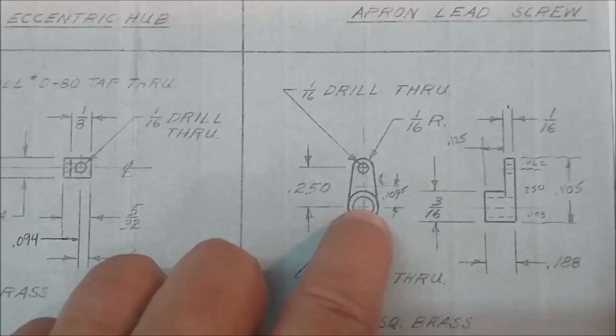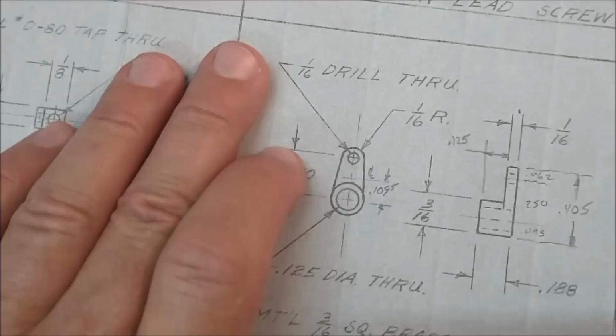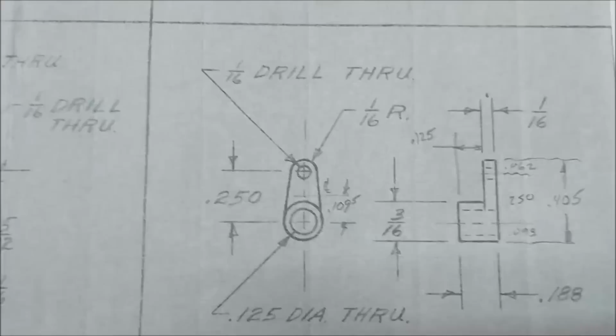This will then be home. I can drill that, I can ream that, I can interpolate this boss, I can remove all of this material, and I will be on center for the rotary actions to cut this side and the rotary action to cut this side. When complete, all I need to do is shift 250 from that point to hit that radius. Then it's over to the lathe to part it off. Sounds easy, should be quick.